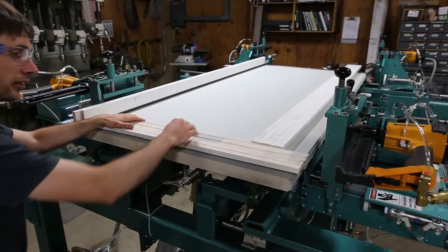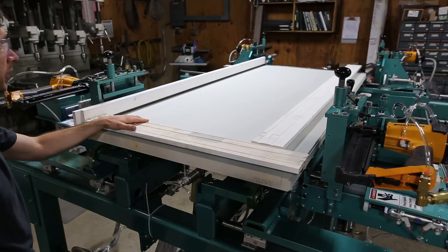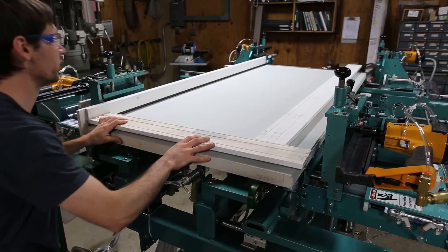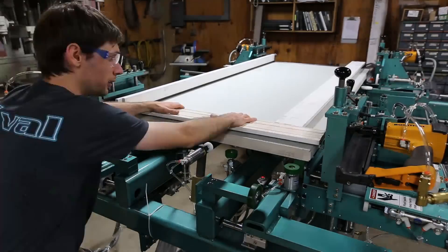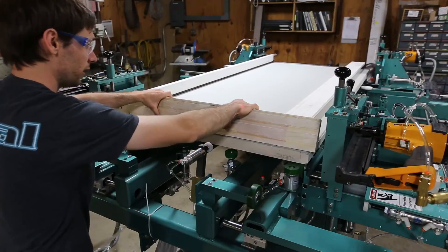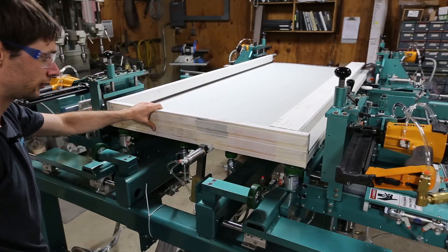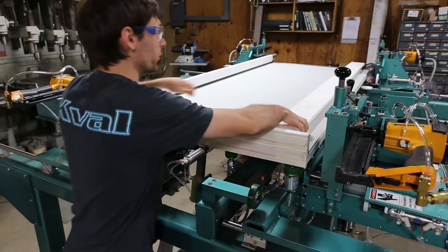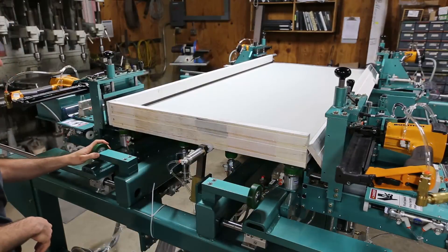So it's doing a single 36-inch door on the 700DX. First sequence — I've already advanced here — it pops up the end stop and you can push your door against the end stop. The second sequence brings up the header stop. You can put your header in, sequence forward again, and it'll clamp the header. Then you can drop your strike jam in place, and then one more forward.